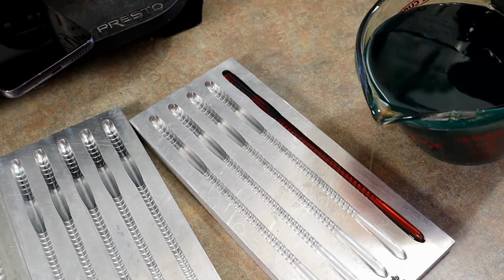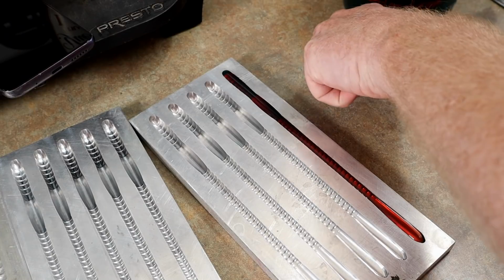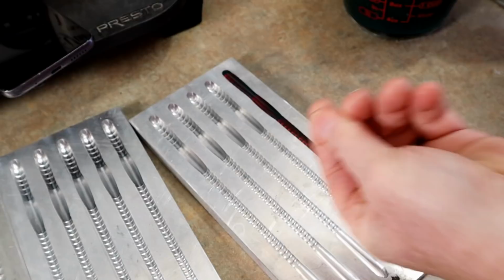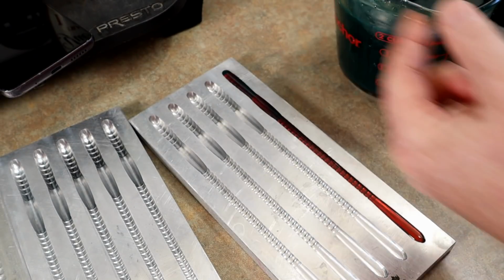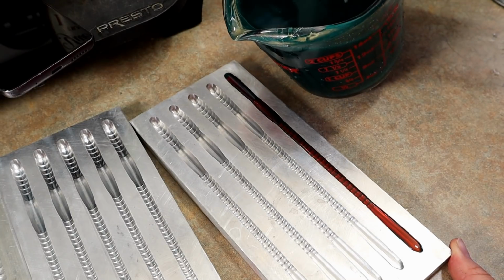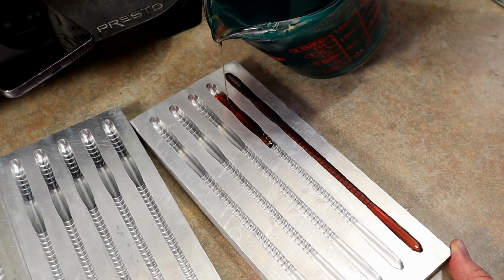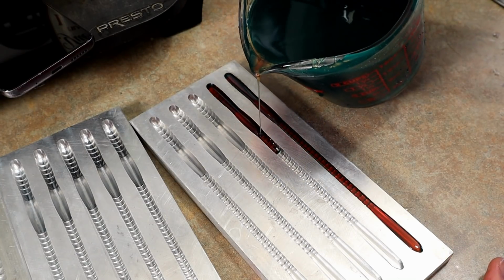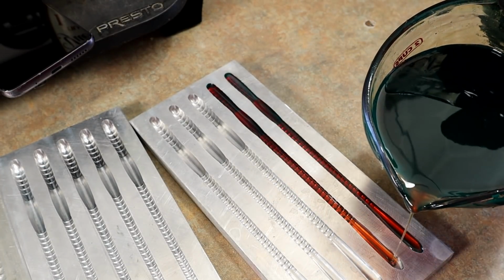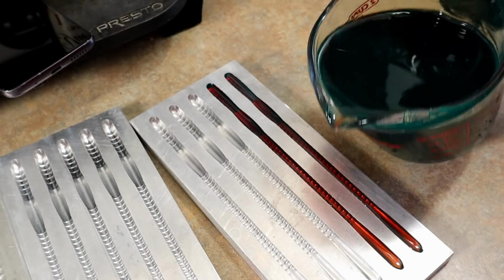And you know, the temperature of the plastic can play a role. I would say, generally speaking, the colder the plastic is, the easier it is to control. However, it can start kind of clumping up and then pouring unevenly. So for something like this, where I need to fill a long, skinny cavity, I actually prefer the plastic to be scorching hot. Now, if I was doing skin pours on a swim bait, pouring layers, I would not pour it this hot. So, just 2 different things for 2 different things.